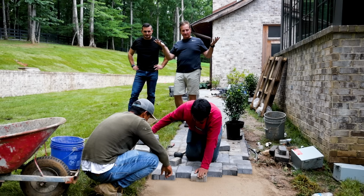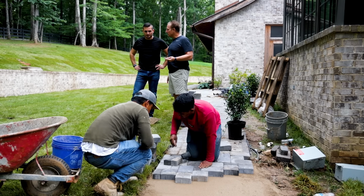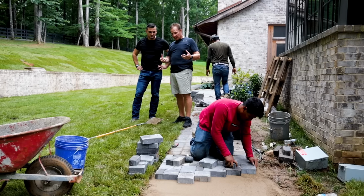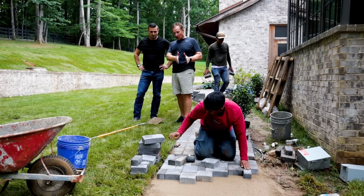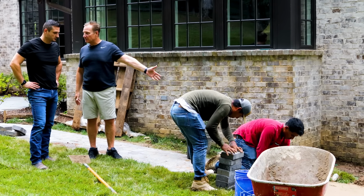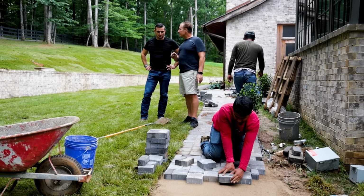You know, our biggest complaint of building pools for almost 40 years now is that concrete, first of all, discolors. Second of all, it cracks. All concrete cracks. The pavers don't crack. They have all these natural joints built in there. If it's going to expand and contract, which all concrete does, it's going to expand and contract in the areas that already have kind of the linear joints in there. It's as hard as concrete. It'll stay like this. This is a 50 or 100 year surface here. It's a little more work, certainly a lot more money, but certainly worth the long-term investment.